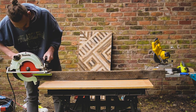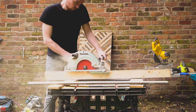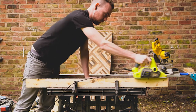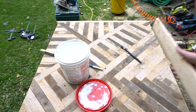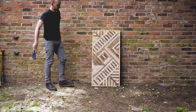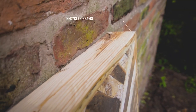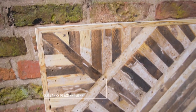Like I said, this was going to be made out of completely recycled materials, and so I used my biggest circular saw to cut strips of the beams that went with the lath and planed up the edges, and they look really, really nice. I think they're probably from the 40s, and then they were just glued and nailed onto the sides with mitres at the corners. I'm really, really happy with the way this turned out. The top needs probably some sanding and some finishing, but beyond that, it's done at this point.